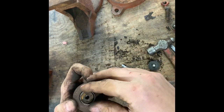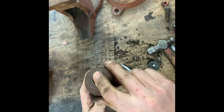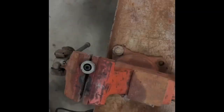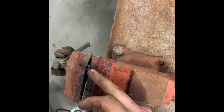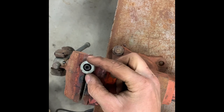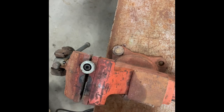So we're going to try to make a bolt with a washer that holds this spring in here, and then that spring — when you pull out on it — it'll disengage. Here's what I got: a screw that'll fit in the threads of that end — they call it the meatball — and I found this washer, it's a little big. I'm going to put it just like that and weld it, then polish it up, grind it down to where it needs to be, and put a screwdriver slot in it.